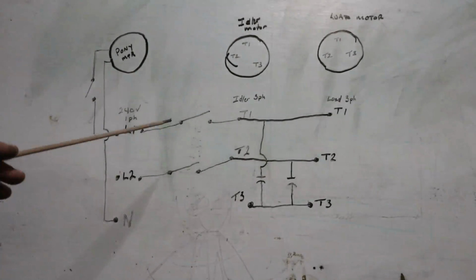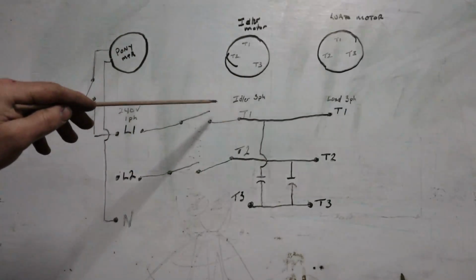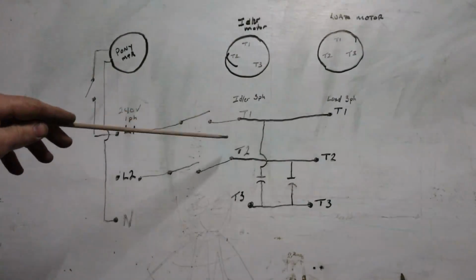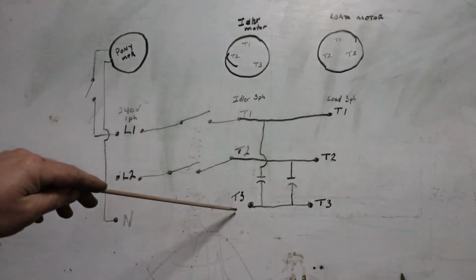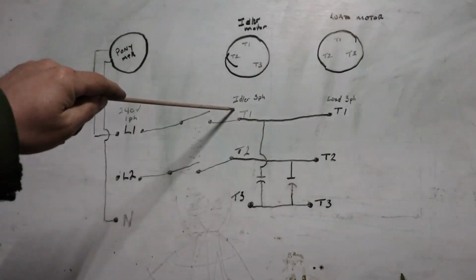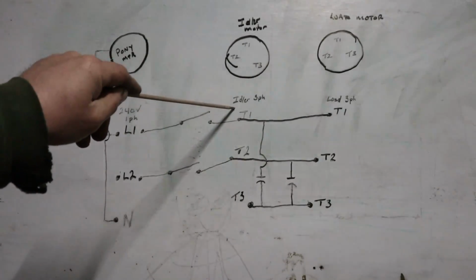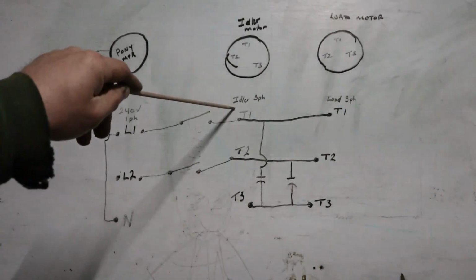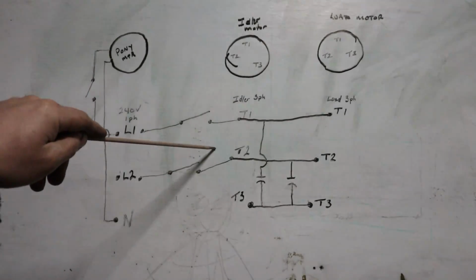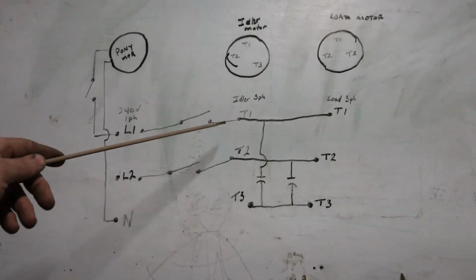So we get to the idler motor. That is the motor that's generating your third leg of power in the system. Say these are the 3 legs of your idler motor. Your motor is at least a size and a half bigger than the load you plan to put on it. That's a 5-horse motor there. I can run up, probably safely, to a 3-horse motor, and I'm only running a 1.5 horse motor for that hacksaw. So I should have plenty of power here.